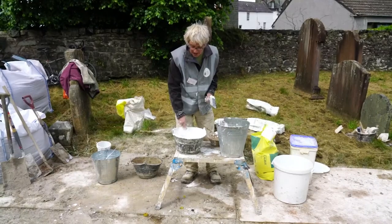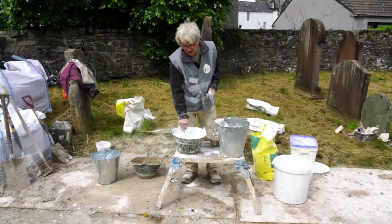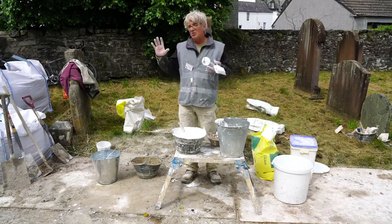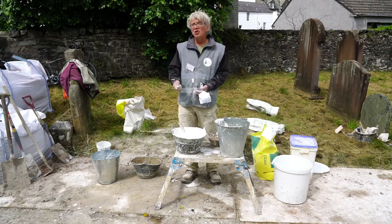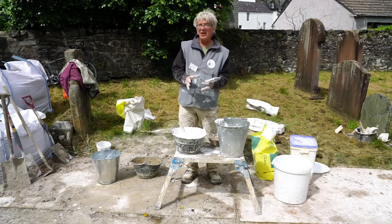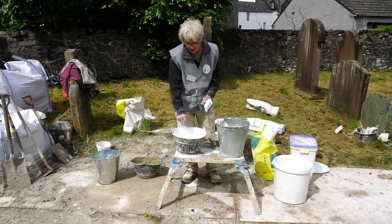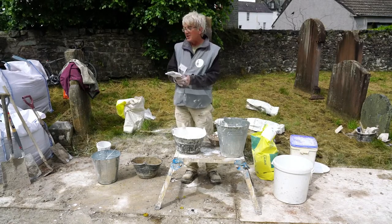And if we were grouting, as I say, the clever thing to do would be to do this on the scaffold next to the wall you're going to grout. Get that, and you'll know, according to all the variables, the one that's going to make it whoosh. Get that one in and pour it into the wall, so that whoosh happens in the wall, because you're getting that stiffening in the wall there. But as I say, so long as it's hot, you get a lovely thick finish.